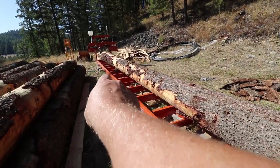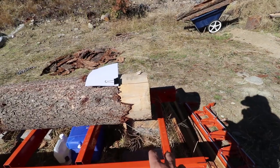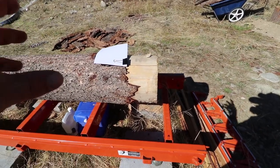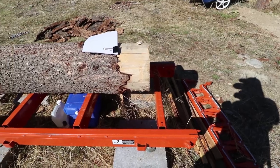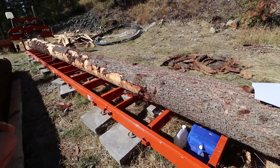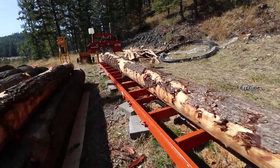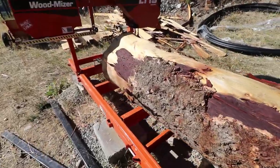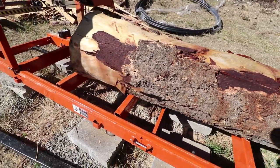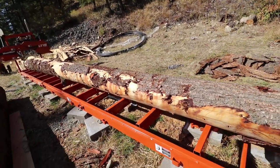What we don't know right now is whether two bed sections with cross members are still miscalibrated. We marked them — they were out in the middle of the sawmill — and moved them to the ends to almost exclude them from the cutting area so we could get our posts straight. But we need to get to the bottom of whether they're in fact miscalibrated. It's so rare that would happen on a Wood-Mizer that there's still the question of whether it's something we've done — adjusted the legs wrong or something else. So today I'm going to try to isolate whether those cross members are off.